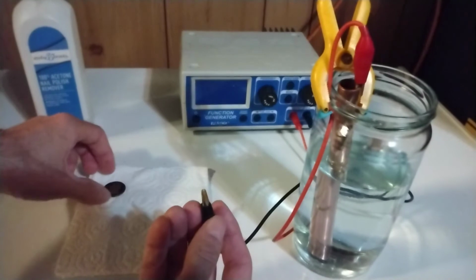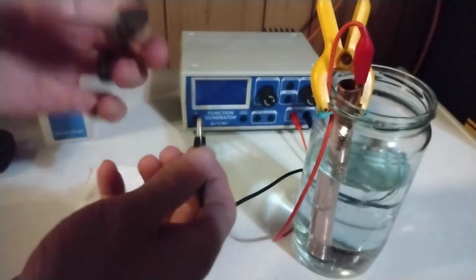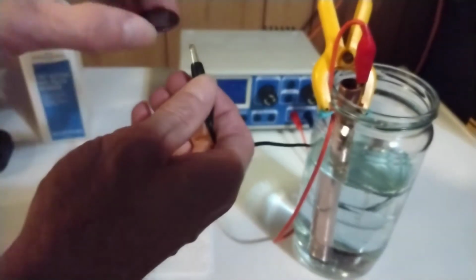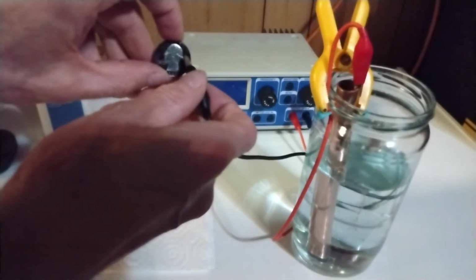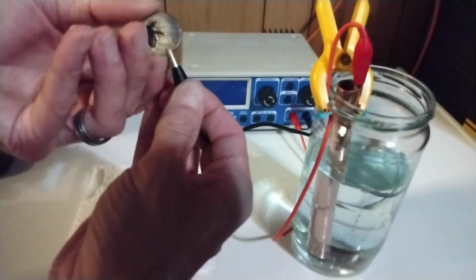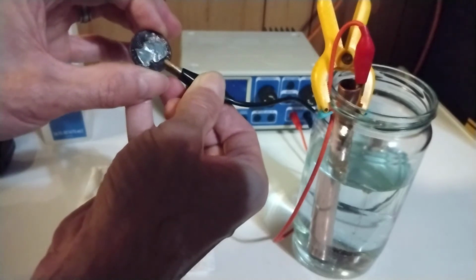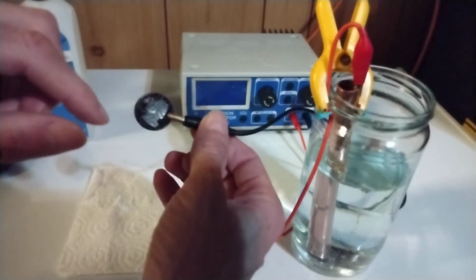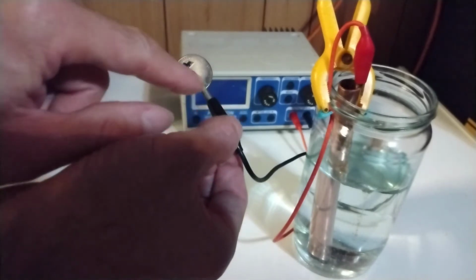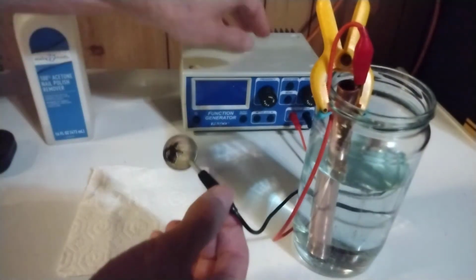And now all we have to do is to connect the piece to the negative, and of course we have to be careful. It needs to be in contact, so I cannot put it in contact with the mask, of course, but on the other side it's okay. If I attach it here, there will be a contact. Maybe here. There will be a little bit of piece that won't be copper plated, but we can do it later. We can move the point where we clip this.